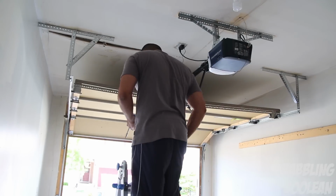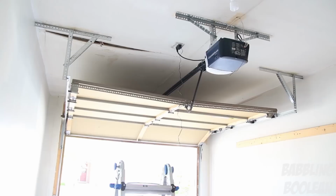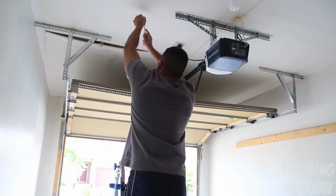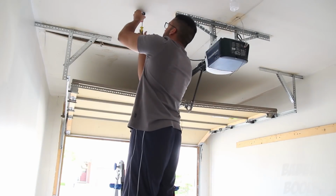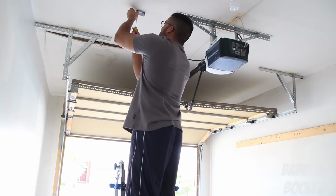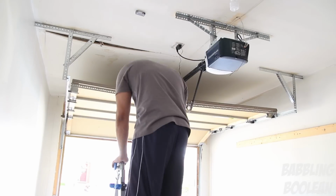The last thing to do is, of course, if you can find the right tool and not go up and down your ladder like me, is to actually mount the garage door sensor onto your garage ceiling. Now, Chamberlain indicates that you should have the MyQ Smart Garage Door Opener at minimum 2 feet away from your actual garage door opener. Make sure you have a strong Wi-Fi connection in your garage, because the way the MyQ sensor communicates with your cell phone, no matter where you are worldwide, even if you're on your 3G LTE data plan, you must have a strong Wi-Fi connection in your garage.